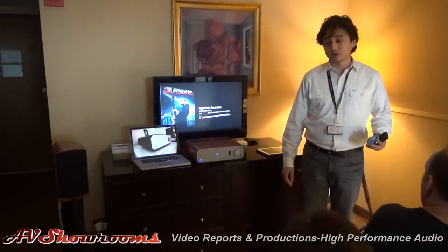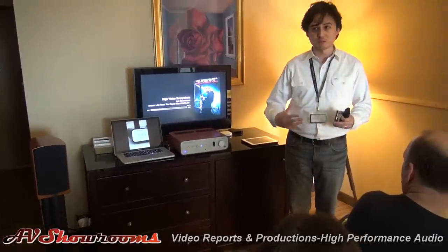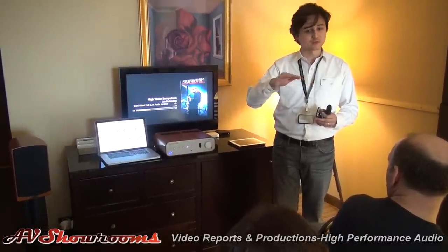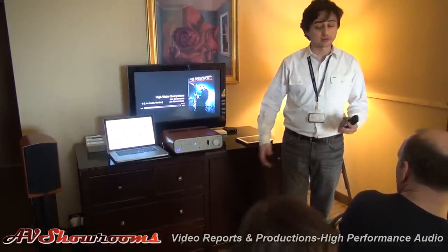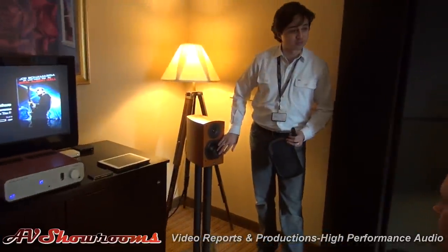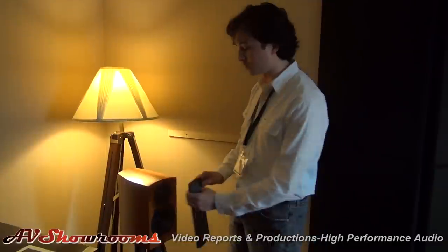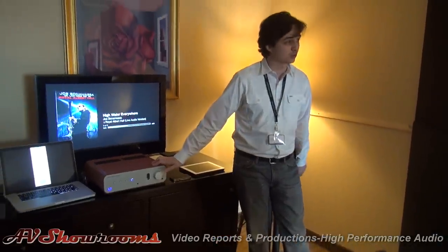There was a question about how much these are — they're $1,000 a pair. They go down about 50 cycles flat response. Unlike most mini monitors that try to reproduce impact and bass where designers put in like 10 dB extra boost at around 150 hertz, we're not doing that. This is a very smooth, natural bass response — as soon as they get down to 50, they just start to slope off. They have a measurable response down to about 45 cycles, again in a 5-inch 2-way. It took Michael Kelly about a year to design these drivers. It looks like a typical polypropylene driver, but behind it is a random fiber cone. This is a 1-inch silk dome tweeter made for us out of Japan — really high-quality drivers. The power we're running into them is 65 watts a side, actually closer to 100, and these are a 6-ohm nominal load.